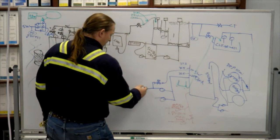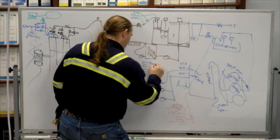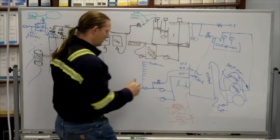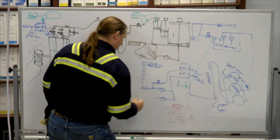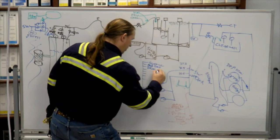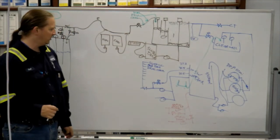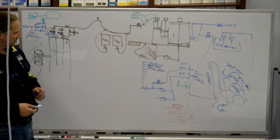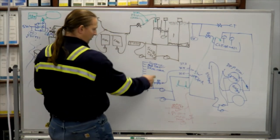All right. So, what all do we use surface water for? Slaking water. FGD tank. Can use it for drag chain. You actually do use it all the time in the drag chain because it's got little spray valves on the chain that are supposed to keep the sprockets from getting clogged, as well as emergency makeup for the bottom ash drag chain.